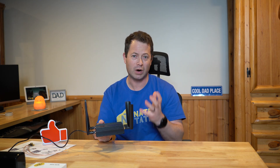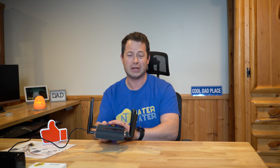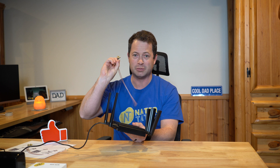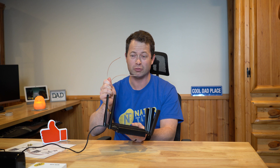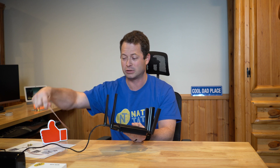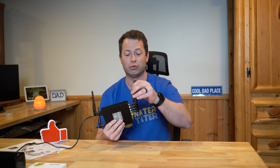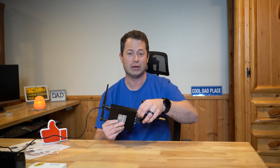First, a brief explanation about wireless signals and why it matters to have an external antenna. I do a lot of videos on T-Mobile and Verizon home internet. For those stuck with a gateway, I've done modifications with special connectors to get SMA connectors out of them. The PepLink devices already have SMA connectors, so you can literally unscrew the stock antenna and screw right into a cable going to your external antenna.